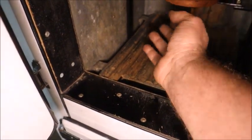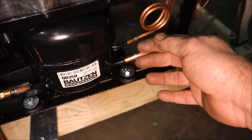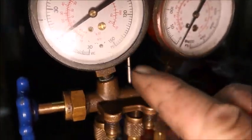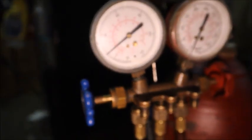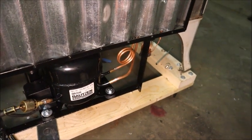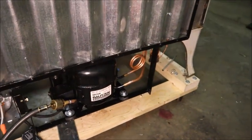This is cold below it too — I can feel the cold air dropping down from around it. Still running like a top: 1.47 amps, 116 watts. Down to about 10 psi on the low side. This tube here is just slightly below ambient temperature, indicating there's no liquid flooding back. The system is running R-152a, which is close to R-12, so following the R-12 chart, that pressure would be roughly zero degrees. I can tell by feeling it's not zero degrees, so it's not flooding back — the system is operating at its peak.